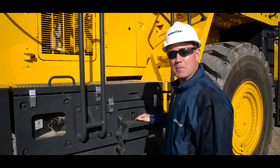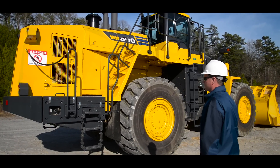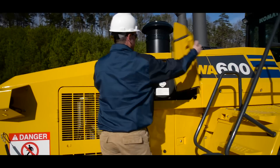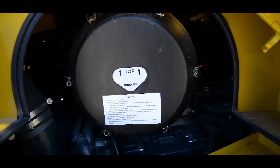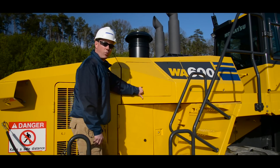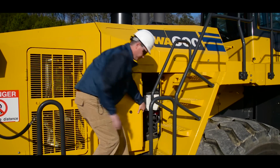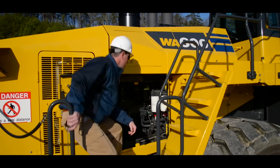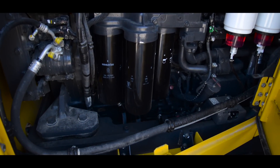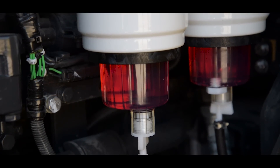Now we're ready to mount the right side of the machine. But before we do that, we want to take a couple steps back to make sure the handrails and access points are secure and in place. The first check we're going to do is of the air filter — making sure all the latches are secure. Once everything checks out, we move to the engine compartment, checking for nothing loose, no leaks, and no debris. We also want to check the sediment bowls on the pre-filters to make sure there is no contamination in the fuel system.